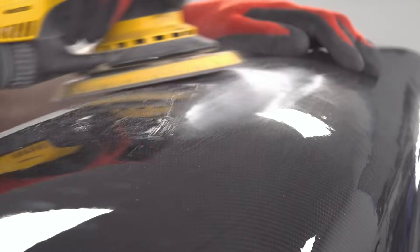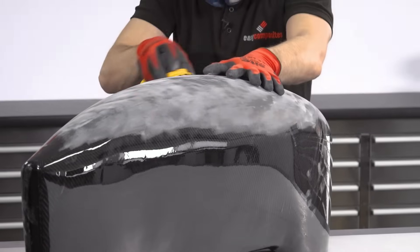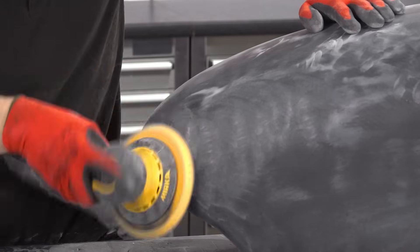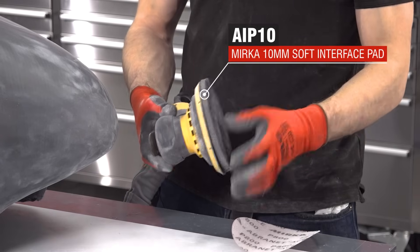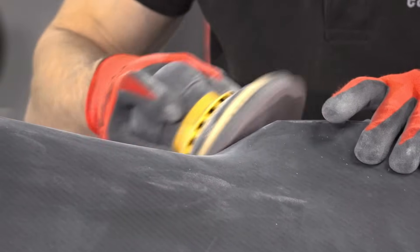This way of making carbon fibre parts does involve a lot of sanding — probably about four hours total in this project, and you could easily double that if you were hand sanding. This round of sanding starts at 400 grit, which very quickly levels out the nibs and can be used to slightly refine any slight irregularities in the surface curves. After the 400 grade, we move on to the 800, where I'm using a foam interface pad as this will increase the contact area on compound curves, which will improve the coverage and reduce the risk of missing areas. On this part it takes about 10 minutes per grade.